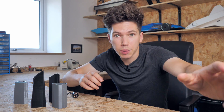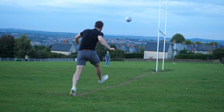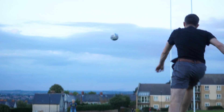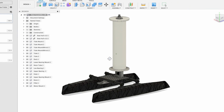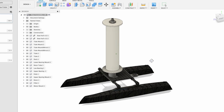The Magnus Effect is a super cool bit of physics, so let me show you how it works. This is Joe, and he's going to kick a football. When Joe kicks this football, he uses the Magnus Effect to curve its trajectory — air is dragged around the ball and deflected, which subsequently pushes the ball the other way. So I decided to design my own boat to harness this effect using a motorized vertical cylinder. As wind hits the spinning rotor, it will redirect the air and create a thrusting force.